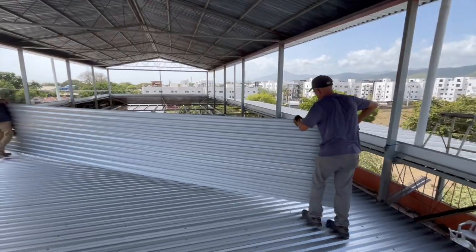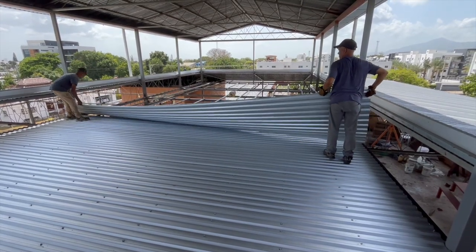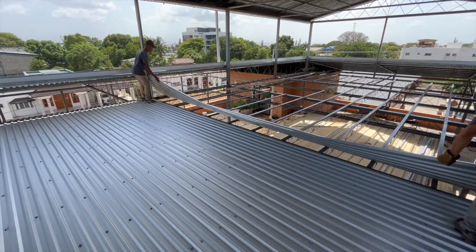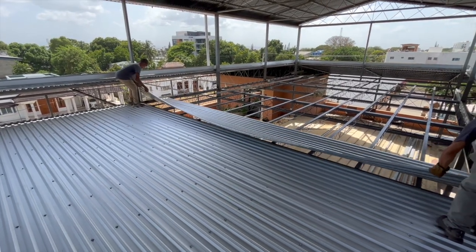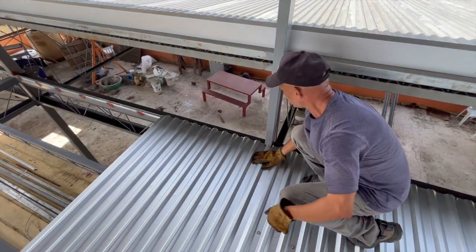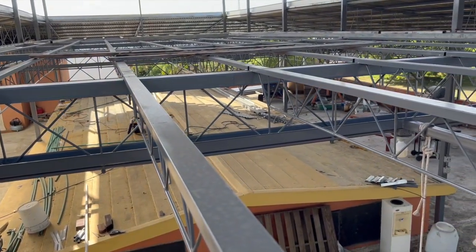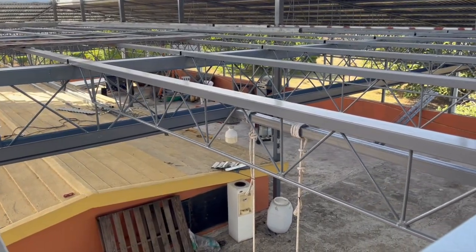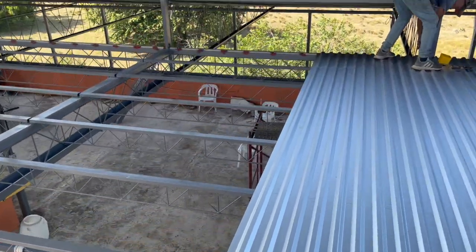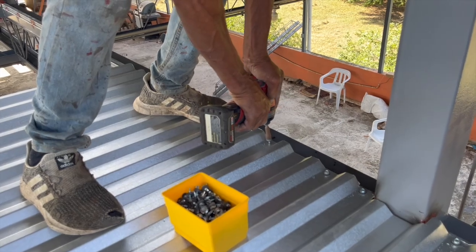Why build a bar joist when you can just buy beams? Beams tend to be a lot heavier for the weight they can carry and can be more expensive, though it also depends on labor cost. Where labor is expensive it may be more cost-effective to use beams; where labor is lower, or in multi-story buildings where weight is a big criterion, bar joists weigh a lot less and can make the overall structure lighter. I hope you found this video thought-provoking — I'd love to hear your thoughts. Have a great day, and remember to like and subscribe!